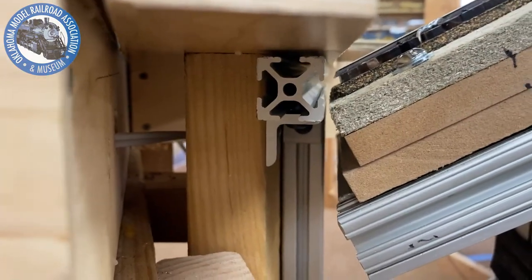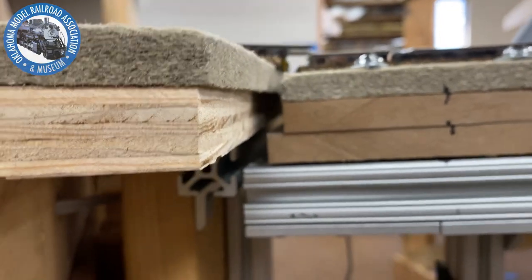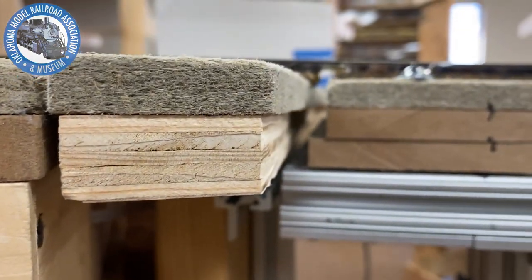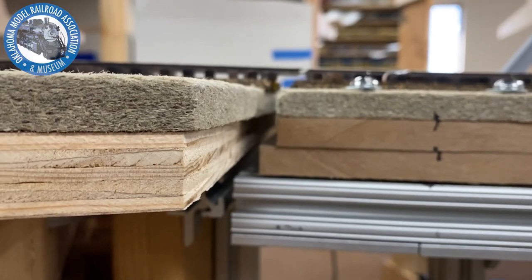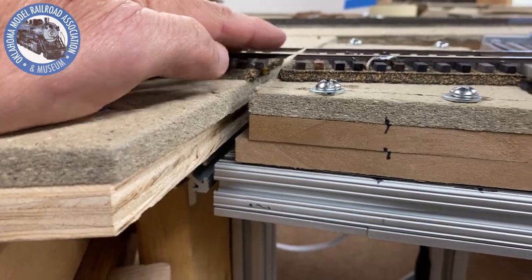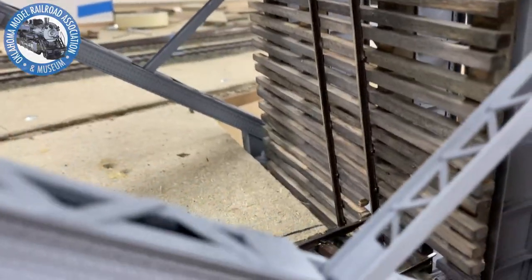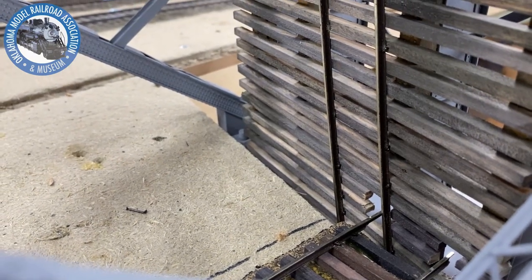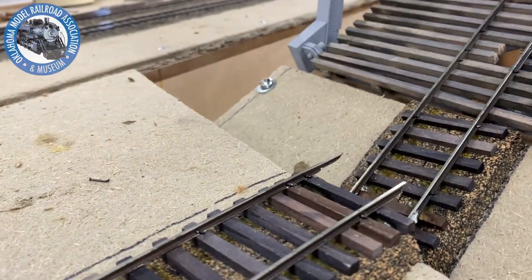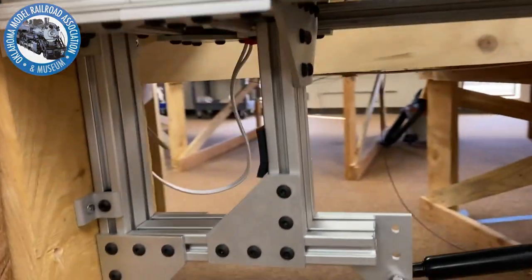Also, as you make your material thicker and thicker, that rail travels in a horizontal fashion. That's why everything's cut back at an angle. It's actually kind of a circular deal. So if you're going to do something like this, you need to be prepared for the upper rail to be protruding out about two inches into this once it's completed. You can see what we did here. We put some holes here and let it flow through the ties. Not even the depth of the ties, but we kind of knew that going in. If we positioned the gate just a half inch farther away, then we wouldn't have that, but that's just the way it came out.